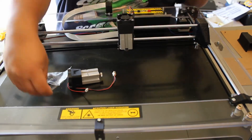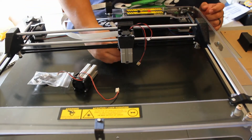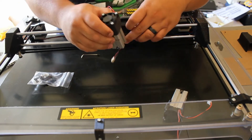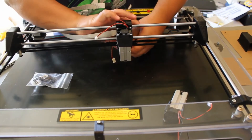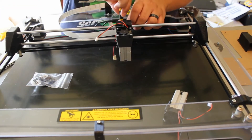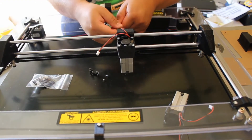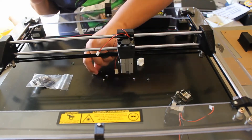For the laser removal and replacement, the easiest way I found: first take off the PCBs — begin by unplugging the laser assembly on the back side of the laser module PCB, then remove the limit switch on the lower right side and the PCB behind the laser. Next, there's a set screw on the bottom of the laser unit — remove that set screw. The laser won't fall out; it's pretty snug. Once you remove the set screw, the whole assembly slides off the bracket.